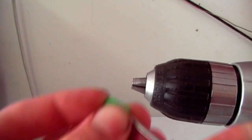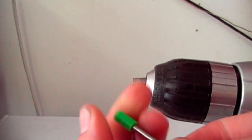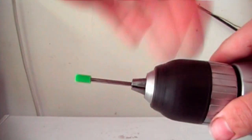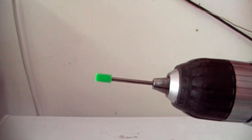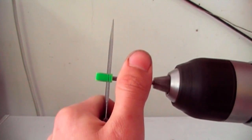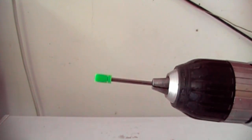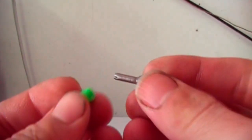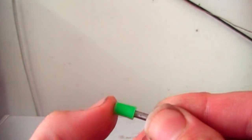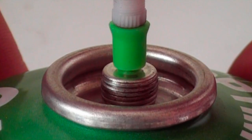The last step is to add the rubber seal. This is made from a short piece of silicone hose used for gas-powered radio-controlled models as fuel line. This piece needs to be shortened a bit — this is the best way I have found to make a clean cut on this stuff. You can see it has left a nice clean square edge to the hose. This is important because this will be squeezed against the face of the valve to make a seal.